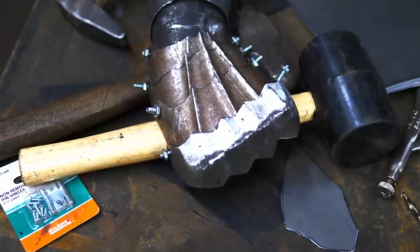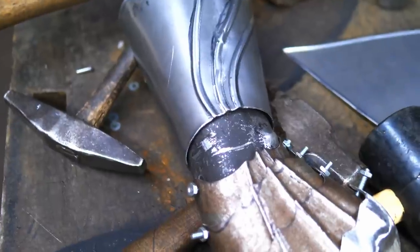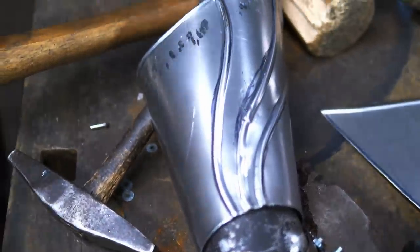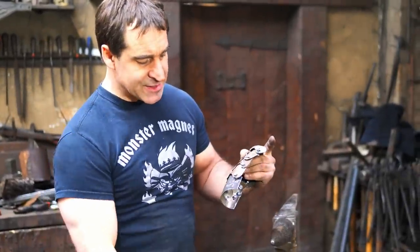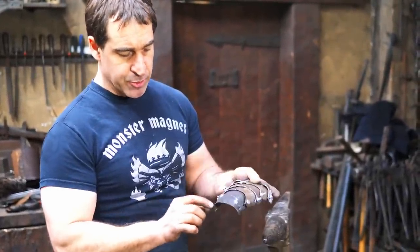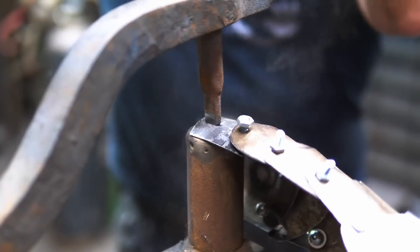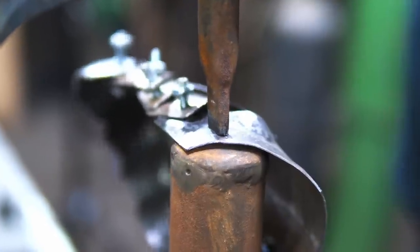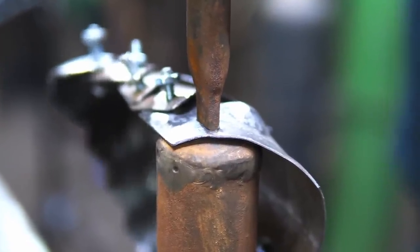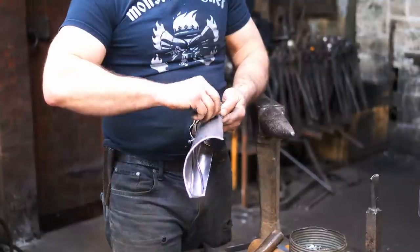The piece is roughly shaped now and I think that's working out okay. What I'm going to do now is lay out the holes here and get it actually fastened to this piece and see how it moves with it. I punched my two holes there, lined those up, made some little marks for slots — I want to put two more slots in there, so I'm going to figure out where to put my slot punch and knock those out, bolt it in and see if it works.